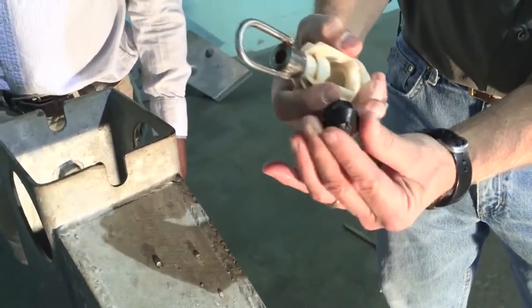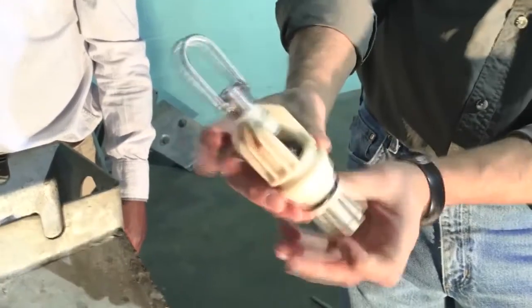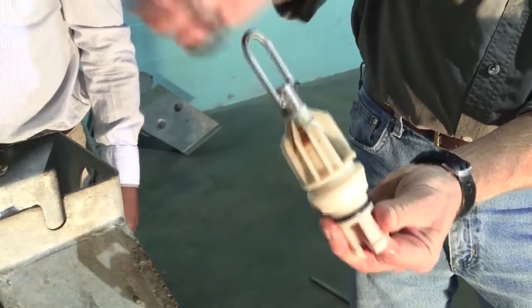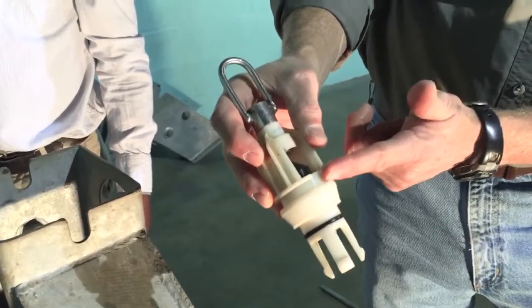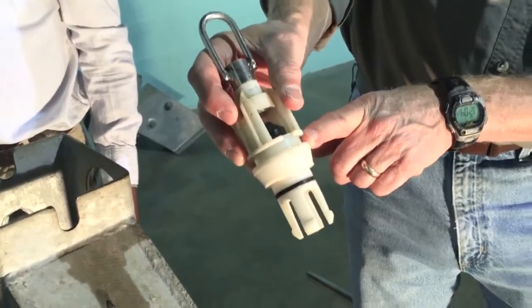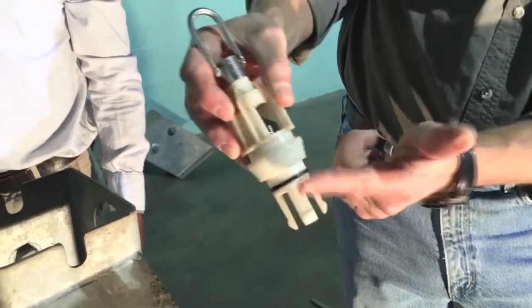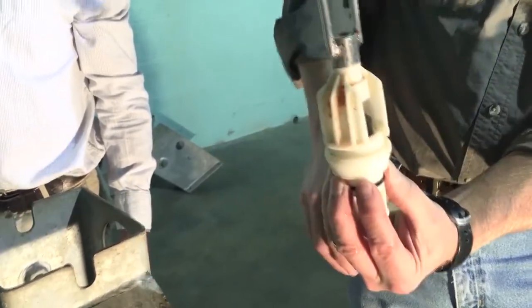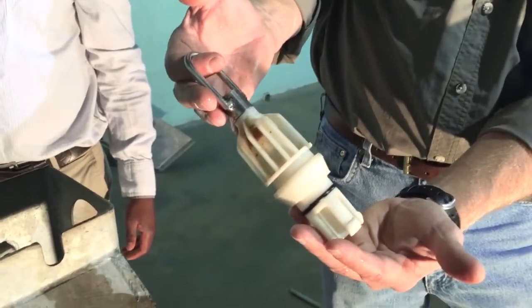You want to inspect the actual check itself, make sure that it's good and intact. Put it in and roll it back into place, making sure it moves freely. Notice this has a loop on top — that is so you can remove it with the removal tool. On the top check valve we had a cup seal, but on the bottom check valve, or foot valve, these clip in and hold it into place. This is the o-ring seal in the bottom groove, which allows it to seal into the bottom of the cylinder.